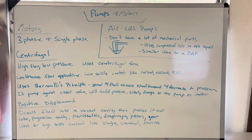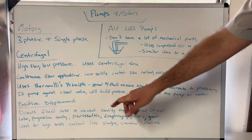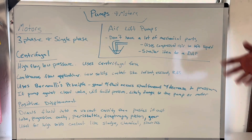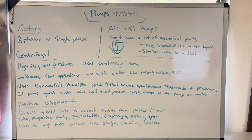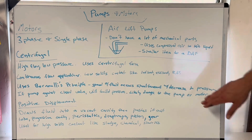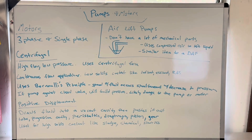If you get a question about what kind of pump you should not have a closed valve against, they're looking for positive displacement — because it'll blow things to smithereens. It will break stuff because these build a lot of pressure. But with centrifugal pumps the damage is most likely going to be to the pump. I think that's a pretty good overview of centrifugal pumps — if you want to add something, comments below as usual.